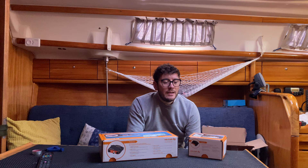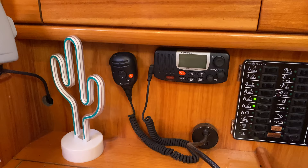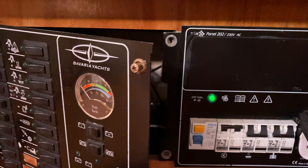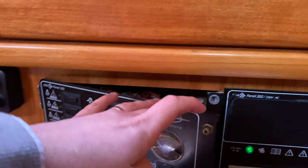I'm going to share what we've already got on our boat and how we're going to connect these up. The first obvious question is why not just swap the VHF for a transponder version — but the cheapest transponder radio I could find was around £1,000, so that was a no-go. Also, in this nest of wires here, we have no NMEA connectors, and the SeaTalk is only connected to our upstairs plotter, so whatever we're putting in we need a VHF splitter.